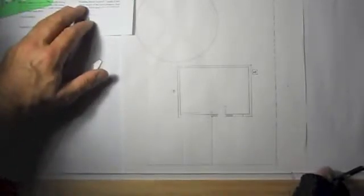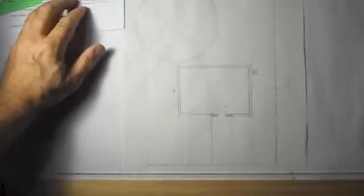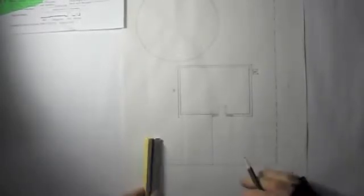Now the other thing that we need to do, let me get some more light on that. You can see where that is now. There is an easement. So most properties, especially in the city and also out in the country, will have a 10-foot easement away from the street. And that's where all the utilities are. That's where maybe if they want to widen your road someday, it gives them that right to do that. Sometimes it's also called the right-of-way, but there's different kinds of easements on properties. And this one's 10 feet.